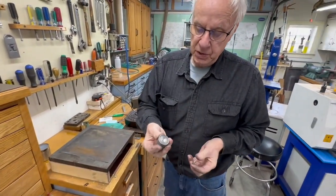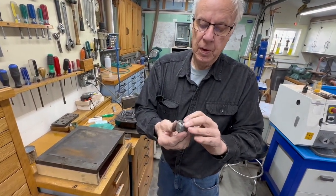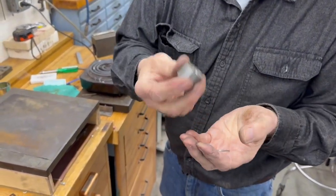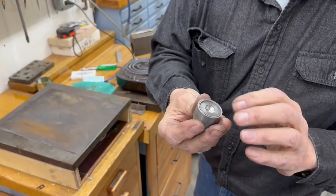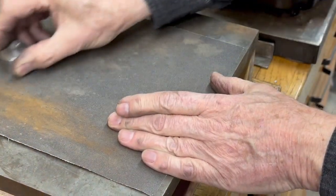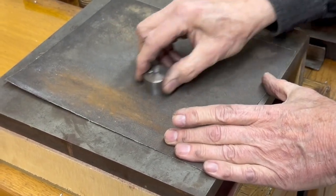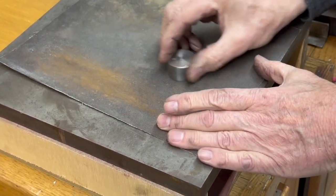To size these, I made a little fixture that holds the rings. You can sand both sides of it, and if it's a hair over you can take off a few thousandths. You don't want to be taking off 10 or 15 thousandths this way, but you can take off a couple of thousandths pretty easily. It really should go in a figure-eight pattern, which is kind of difficult, so I usually rotate it a little bit to hit different spots.